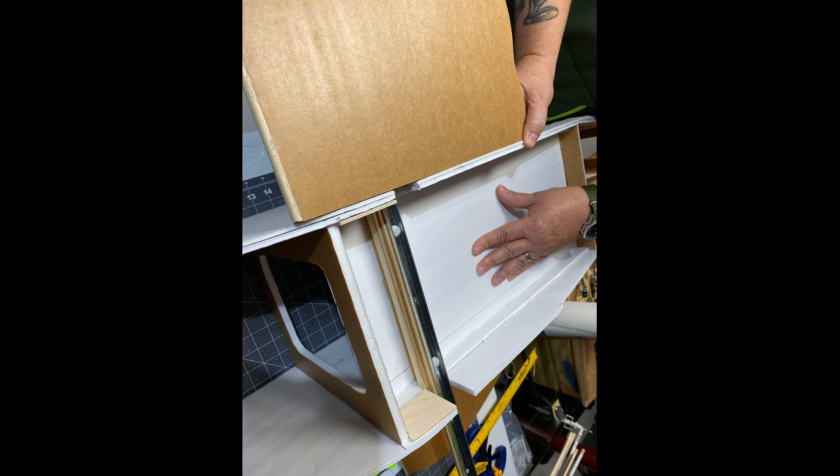I'll spend a little time on this slide. What you see here is the main spar of the bottom wing being test-fitted into the fuselage. It's doubled up with plywood and aluminum U-channel that extends pretty far into the spar area. It's a combination of yardsticks, U-channel aluminum, and nylon bolts for reinforcement. Starting to put plywood reinforcements along the fuselage — the whole front edge from the spar forward is reinforced with plywood sheeting. Some of this is for T-nuts, some for strength.